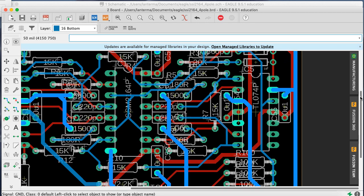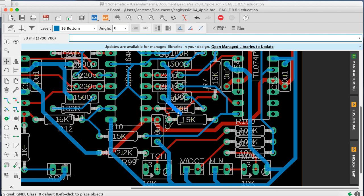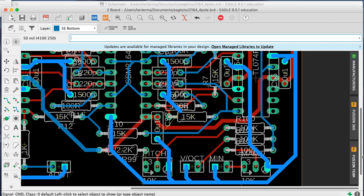There's not an easy way to snake that through. Oh, there's several places to do it. Oh, you know what? Let's do this. So I'm going to rip up. Oh, this is actually not that terribly tricky. What we'll do is we'll say okay. Do I want to just go ahead and put in vias there? Nah, because let me think for a second. Oh, no, because it's got to cross this no matter what. And this has to come over here.